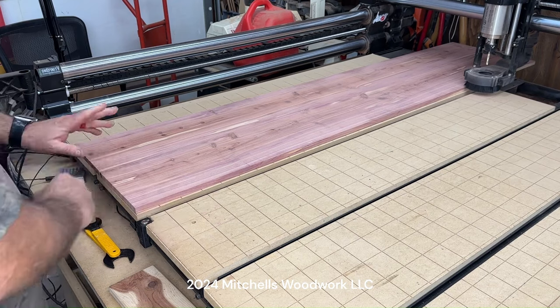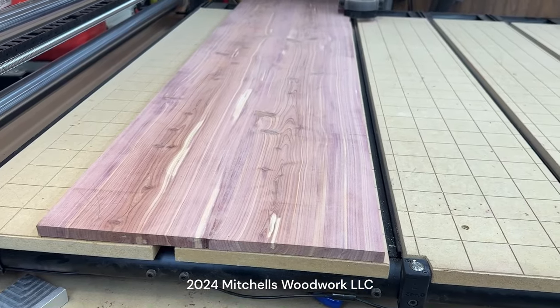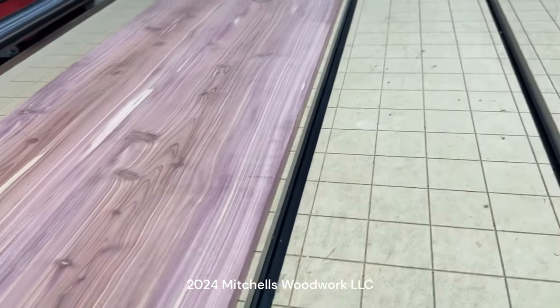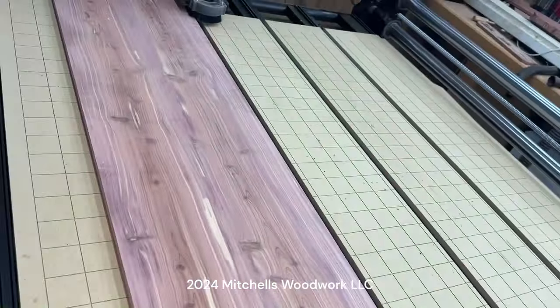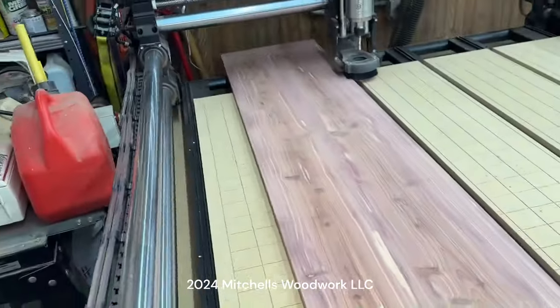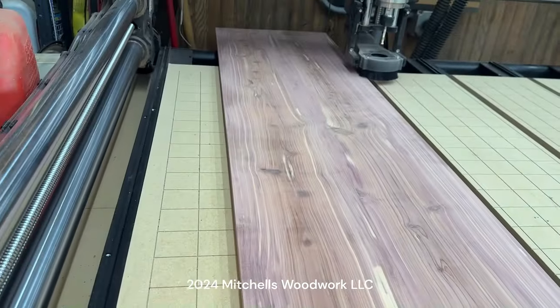And now I'm gonna show you what I'm looking at from this angle. All right, so this is the first tile cut I've done on this new machine. And I'm already seeing how much simpler this is going to be than it was before, mainly because of my grid pattern. But also, if you don't have a grid and you have the T-tracks, you can use those too, but the grid is something perfect to line up on and make sure that you're straight where you want to be. I've just got that one set. That edge is right on that line. And that way, after the first tile, when I slide this down, I know all I have to do is keep it on that line for the second tile.